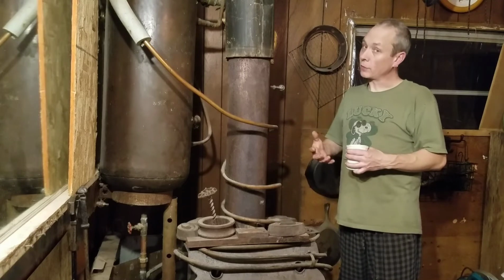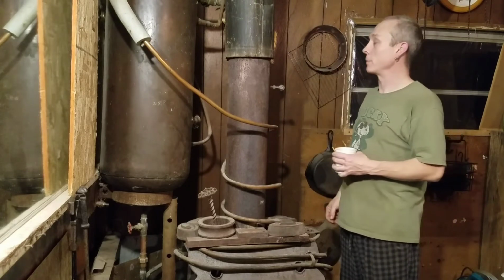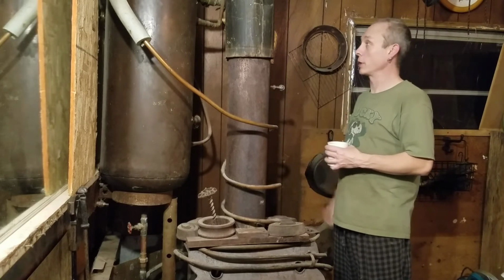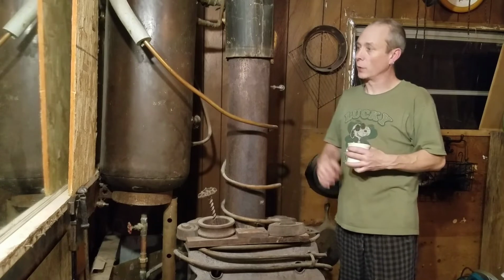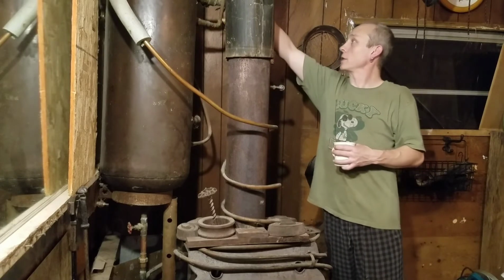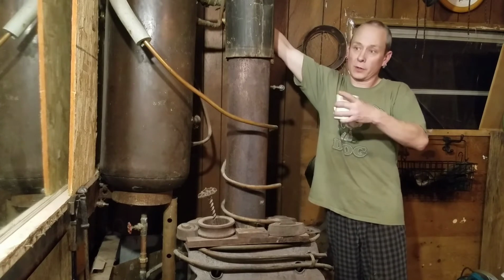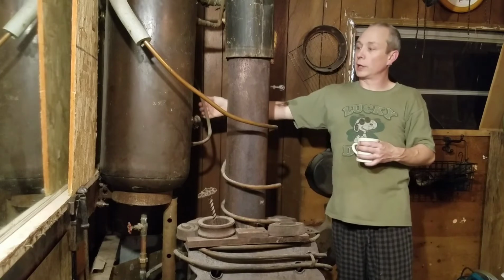You do have to be careful because it, like I said, can get up to about 150 degrees of hot water temperature coming out the top of this. Your typical hot water in your house is 115 to 120. There's a temperature and pressure valve right here. This is the line going out to my hot water heater, or in this case it goes right past it and into the system. And this is the cold line coming in.